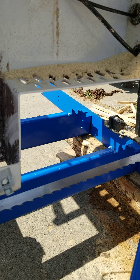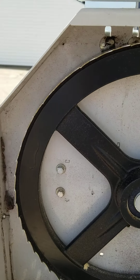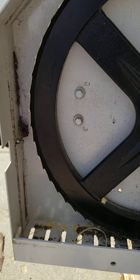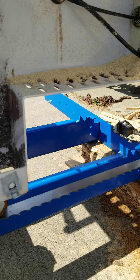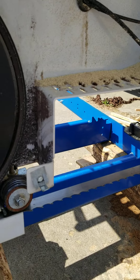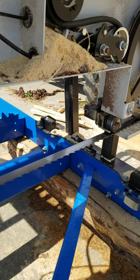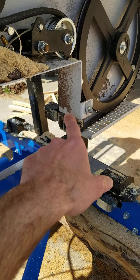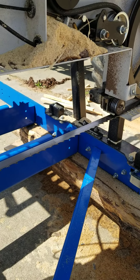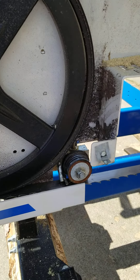I'm going to run some tests on some hardwood too before I really release what I want to do with this product and start possibly selling it for sawmill care. It's a good thing to do before you shut the machine down — say you're running your last log, your last cut, disengage the drive, spritz these areas by your roller bearing guides and a little bit on the blade, then just engage it for a few seconds and shut her down.